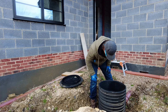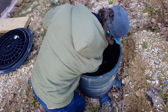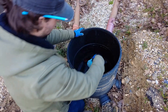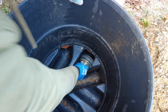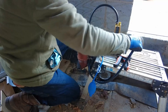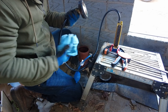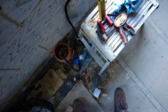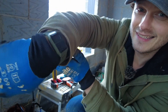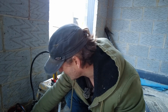You need to make sure there's no soil grip around the pipe or anything. I'm going to test that run first. It does smell a bit earthy because the water sewage treatment plant is live. I just took the bung out because I forgot to wipe it and it's got a load of crust on it — that would have affected the test. Ready to test — my phone has run out of battery so grab one of these. Five minutes — I'll pump it up to 100.